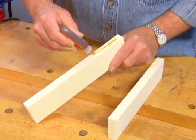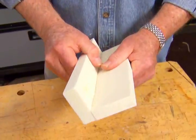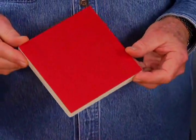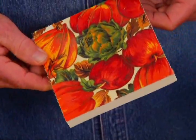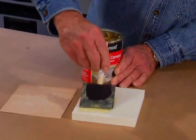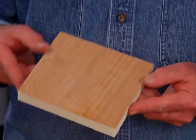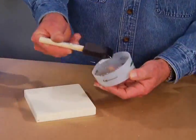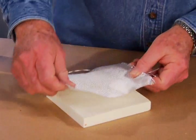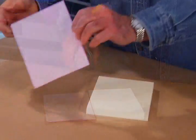Polyurethane glues are highly compatible with this material and produce a bond that's stronger than the material itself. INAKOR can be bonded or laminated to a number of different materials using a variety of adhesives: wood veneer using contact cement, fiberglass cloth using epoxy resin, and foam, fabric, and foils using spray adhesive.